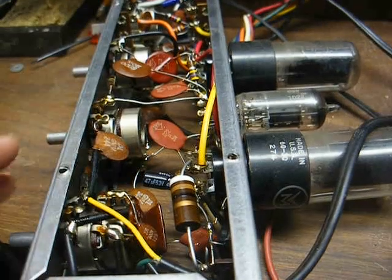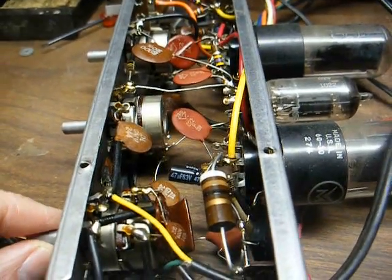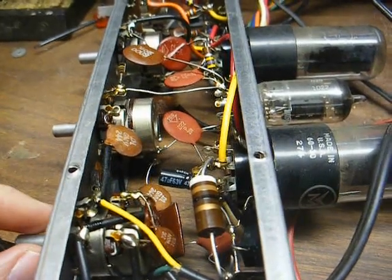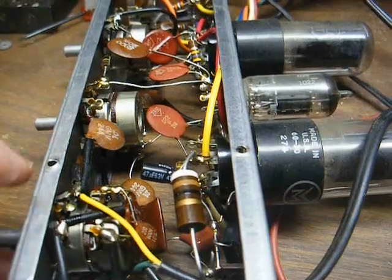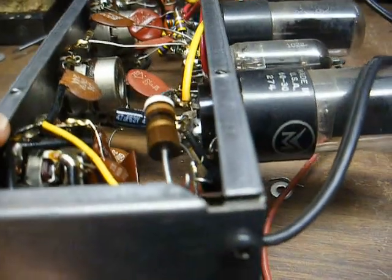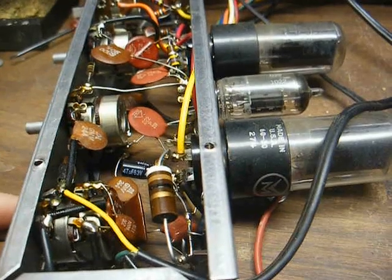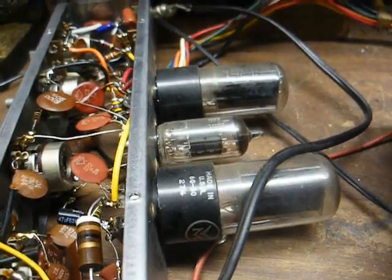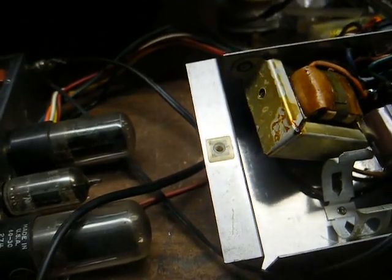And on the main amplifier chassis, I cleaned all the controls and replaced any paper and electrolytic capacitors that were present, even though those tested fairly well and could have probably been left alone, but we all know how old capacitors can behave. They might go another 50 years, or they might go belly up next week. Okay, well that should really take care of it this time.